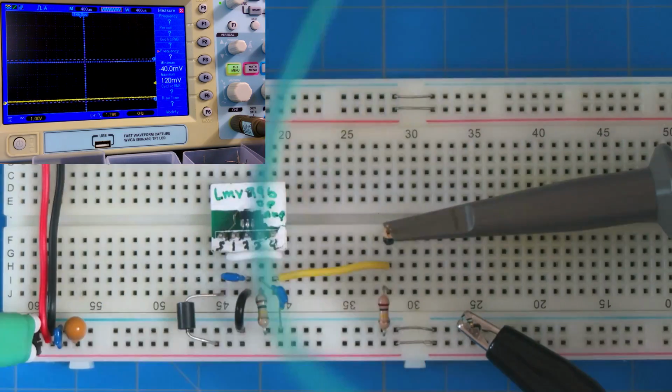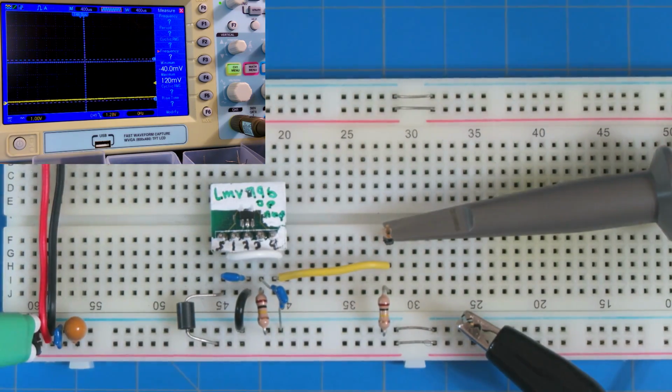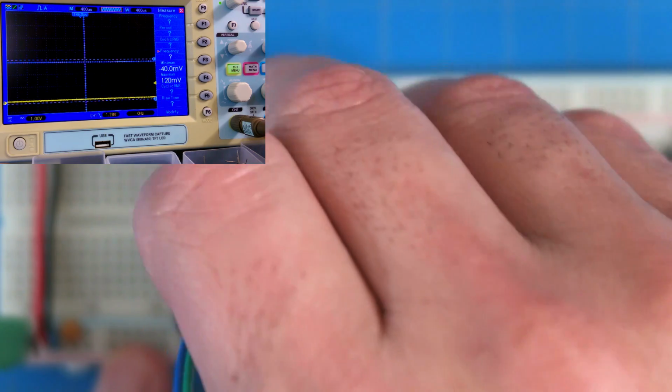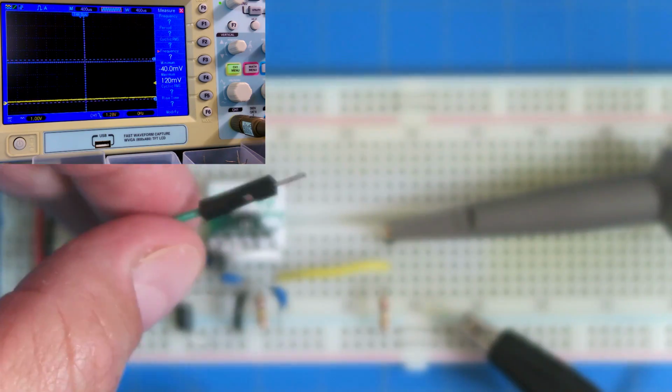Okay, now we're missing one thing. What are we missing? We're missing the force sensing resistor. So where does the force sensing resistor go? Back on the other screen, which I'm not going to switch to, it needs to go to the plus rail, the +5 rail. So here's our input right here. And this is filtered, so I want to take the filtered one. And then it goes to that resistor.